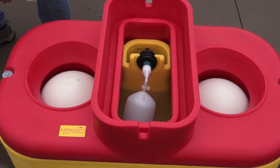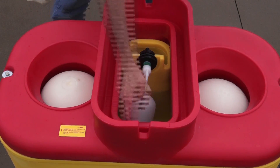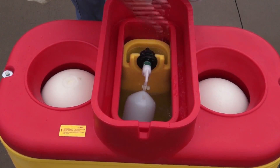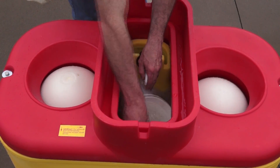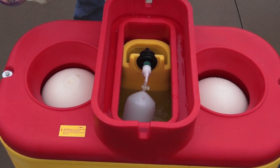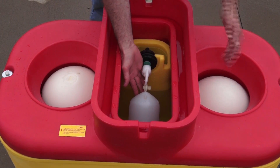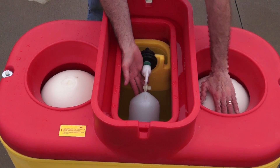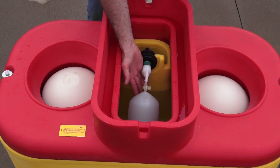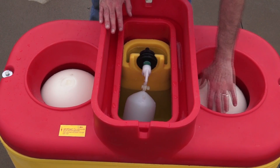My float is now shutting off my water supply. I need to get a little water back in my track up here — I'm just going to take a little water and put it back in there using a bucket or my hand. I've got my float set so that my ball closures are sitting at least a half inch to an inch below the place where they would be tight in my top panel. This allows any water that drips off an animal's mouth to get back into the unit and not create a freezing problem around the ball.